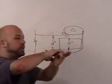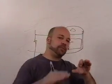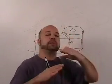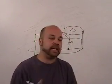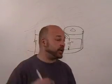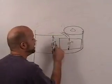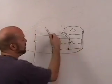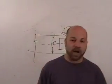Then what he's saying is, and the cylinder is 22 inches around, he's not going to put that 18-inch piece of tape and then put another 4-inch piece of tape to make it a whole lot, which we do a lot. We just wrap the cylinders in wide web completely and slap a plate on there. But he's not going to do that. He's going to factor in, hey, I've got enough tape there to cover the whole thing, so I'm just going to figure out where the center of this plate is, and then I'm going to figure out where the center of that tape is, put them together, and I've got enough tape. I don't have to wrap that around.